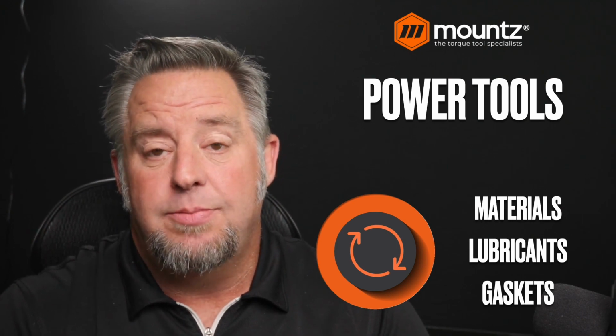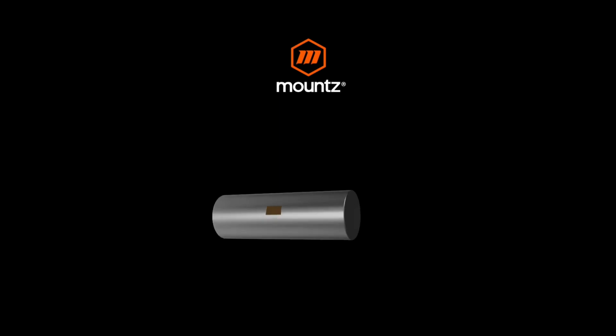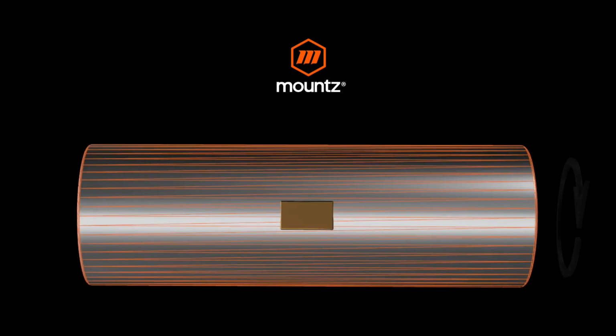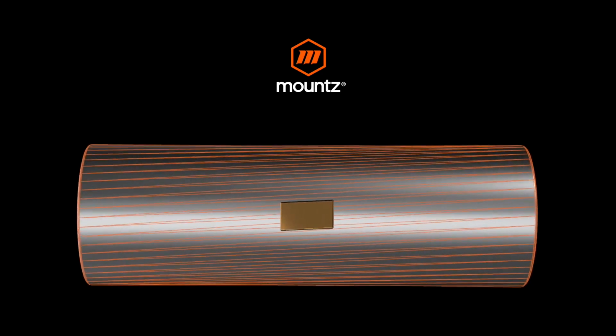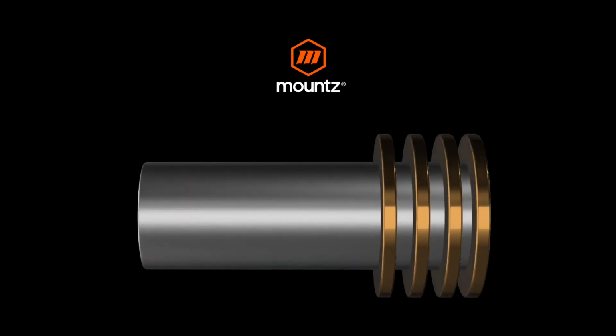And so for us to be able to test that, we would use what would be a rotary sensor. And so what is a rotary sensor? Well, it is basically a shaft that has a strain gauge on it. In this first scenario, this is more of a reaction style transducer, but we have a strain gauge there, an electrified circuit. And as there is torsion on the shaft, we get different resistance readings, or output, from the electrified circuit.